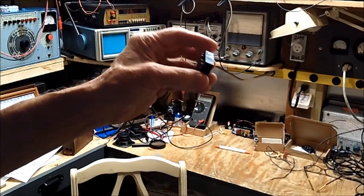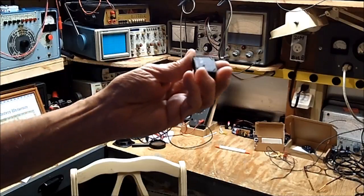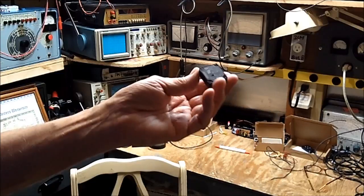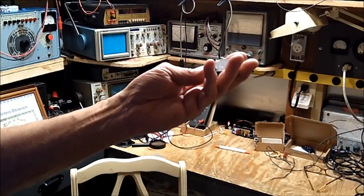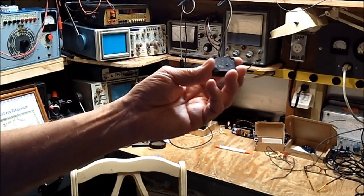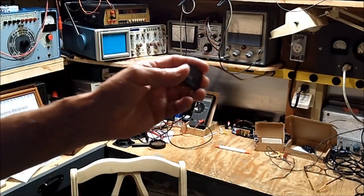These are the little 24-volt relays — they look like a bridge rectifier. I got four of them from Jewett City Flea Market several weeks back. I don't think the 24-volt coil will energize on pulsating DC — it's all experimental. Chances are it won't work at all.